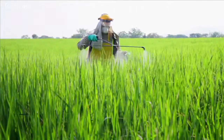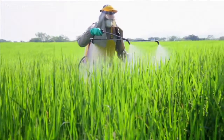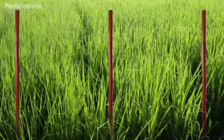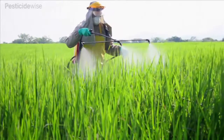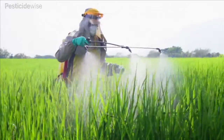To achieve a better spray coverage, you will need to apply a fixed swath width as you traverse the paddy. Mark the field with canes one swath width apart. Spray one swath width at a time with the nozzles at the correct height as calibrated. Keep the nozzle steady.